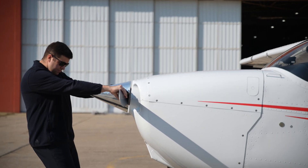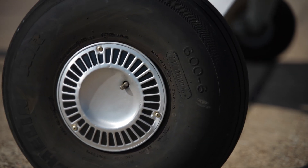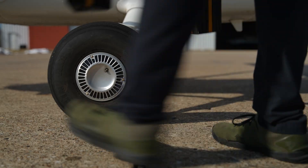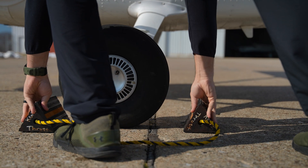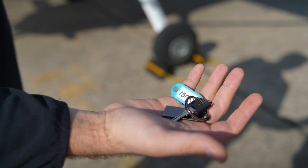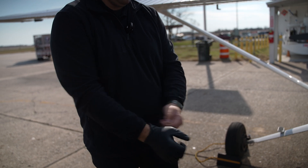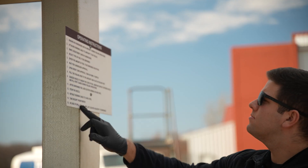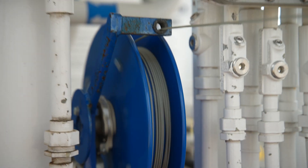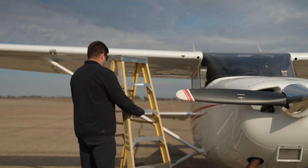First, check where the self-service is located before your flight. Check NOTAMs and comments on ForeFlight to see if there are any closures or fuel outages. Next, ensure the airplane is off and set your parking brake and chocks. Check that the magnetos and electrical system are all turned off. Next, if desired, you can put gloves on to protect yourself from lead in the fuel. Look for posted instructions and verify the correct fuel type. Ground to the aircraft, then set a ladder up if needed.